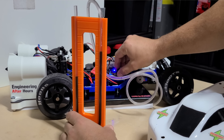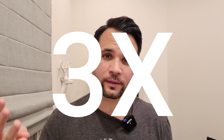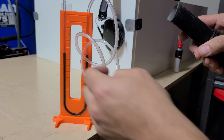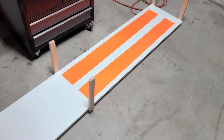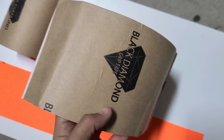To my surprise I was getting between five and six inches of water based on where I measured. That is a huge number that adds up to more than three times the weight of the car and is more than twice my original downforce target. And just for fun let's see what kind of pressure drop we can get out of something like a shop vac. My confidence is now through the roof. I am the second coming of Gordon Murray — who I think is probably still alive, so maybe Gordon Murray Jr.